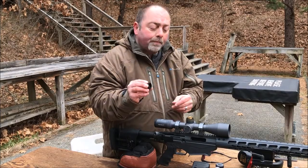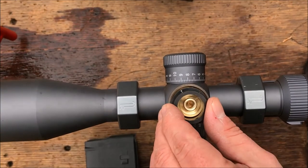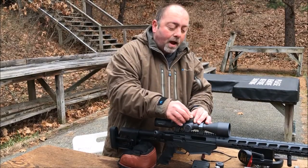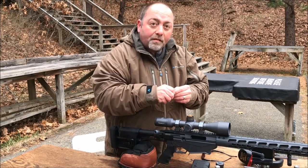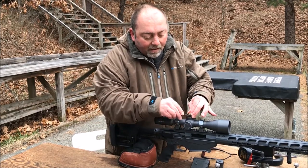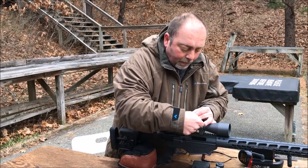Take the ring and place the male pin of the ring on the counterclockwise side of the pin that's in the turret already. Just press the ring down and turn it until it stops again on the counterclockwise side. Once that ring is in place, take the 1.5 millimeter allen key and tighten the three screws that are around the outside edge. Make sure that ring does not move while you're turning it. Get those good and tight.